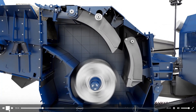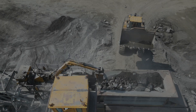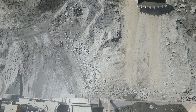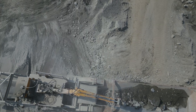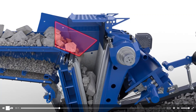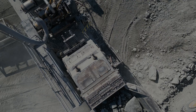For most primary crushers in our fleet, the rock is generally reduced from 24-inch and below to 7-inch and below. In applications with harder stone such as granite, we also use jaw crushers as primary crushers. This style of crusher works by compressing stone with its movable jaw against a second stationary jaw, thus duplicating the result.